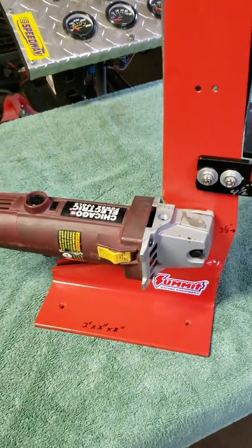This cutout right here is three quarters of an inch tall by one and three eighths inches across. The pivot bar right here is one inch by five and three quarter inches. The hole from here to here measures two and one quarter inches, and the bicycle axle on the inside is two and a half inches.